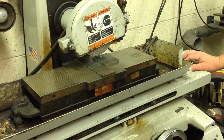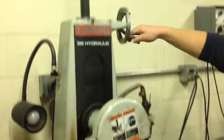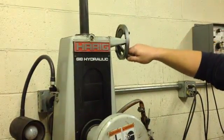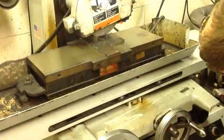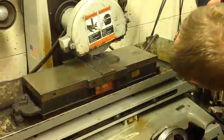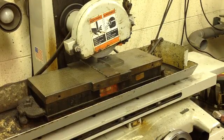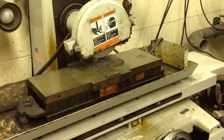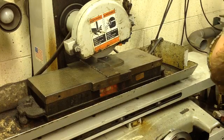We're going to work on just a generic piece of metal and show you how to get it set up to start precision grinding. We're going to work on our Z-axis here and bring our table up or our grinder up or down. We're going to come down and just kind of eyeball to the point where you're not quite touching it, and then you can turn your machine on. Then slowly come down to your material.